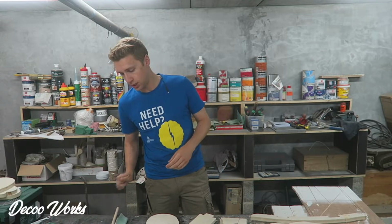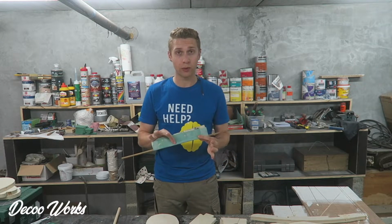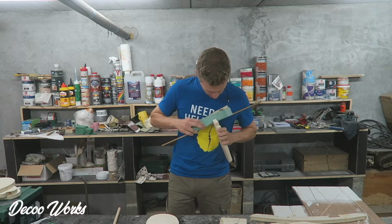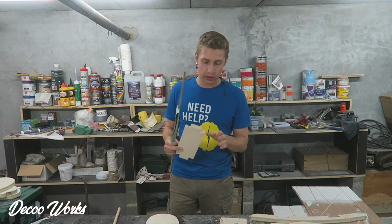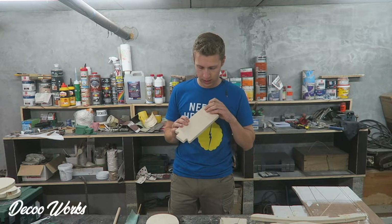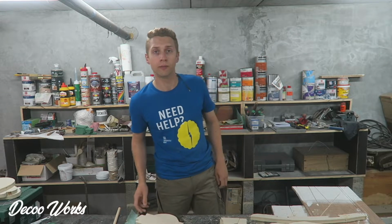Perfect, because, a little tip, you can take a piece of sanding paper, 120 in this example, and then put it around the stick like this. Take your piece with the inside corner and then just go through it like this. And I know it won't be straight, will probably not be a perfect circle anymore, but at least it will be safe for children to touch without them hurting themselves. So that's how I fixed that problem without a fancy spindle sander.